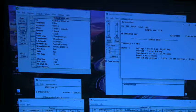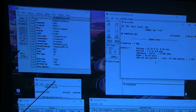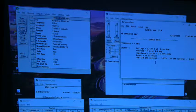Add 10 feet to it. Charlie and I were talking like you were going to move your rig across the room, and you needed 10 more feet of coax added to it. So you add 10 more feet of coax. Now what do you see the impedance is? 26 ohms. So 10 feet of coax has changed what was 77 at the antenna, and 40 or so with 100 feet. You add 10 feet, it's down to 26. You vary that coax line and you can see anything in there, and some of the transitions are dramatic.